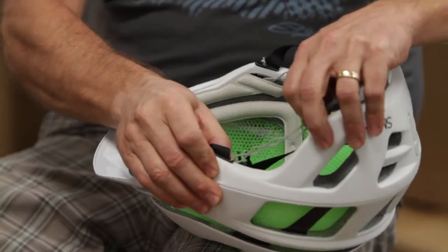We're also using a different material here rather than some of the standard plastics that are out there. We're using DuPont Hytrel, which is actually an elastomer. It's a really rigid, really strong elastomer, but it can cycle through a bunch of cycles really well. It's a great little resin that we use for that.